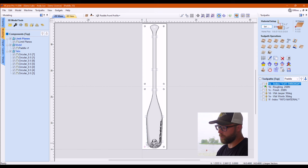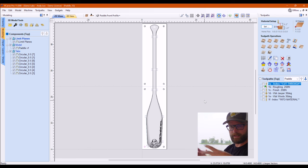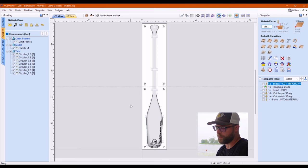I did that because it allows me to flip both ways, instead of having to drill four different sets of holes. So our index holes go all the way through our material and into our wasteboard. I did that so that when we're sliding it, because we are tiling it, I could reuse the holes over and over again, which is also why they are laid out the way they are. That goes against everything I talked about in the guitar, where I said purposely put them in offset positions so you can't screw up your flip. Now I'm breaking that rule because they are in the exact same dimensional positions, so that you can recycle it because it's dimensionally symmetrical.